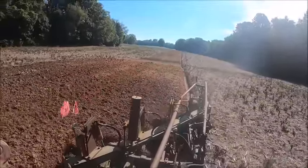Normally, I had a hard time plowing the ends. Normally, when I would do a dead furrow on the edge of the field, I would feather the back bottom so you're only cutting in just enough to lay the dirt over in the end of the furrow of bottom number 4. But the tree roots are growing so far out in this field, I tried doing it and I couldn't do it because the 4 and 5 would ball up on tree roots and just plug the plow. So if I wasn't sunk all the way in the ground moving enough dirt to keep the plow clear, all I'd do is plug up. But his disc has got cone blades on it, so I should be able to fill the furrows in fairly easy. Teeter, come on.